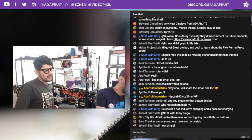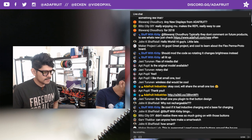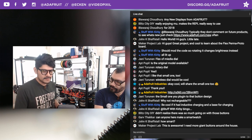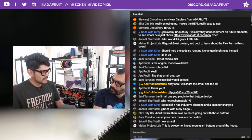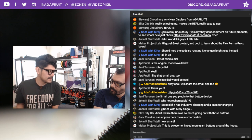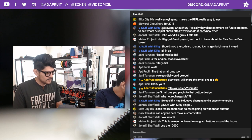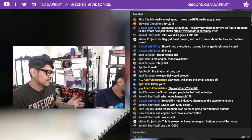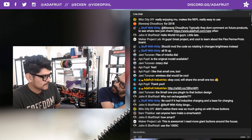So, you could put one of our micro LiPo chargers and wire it to it. Just a little bit more to do. I think the main use for it is we kind of want it to be plugged in to your computer or whatever, because it is using the Adafruit HID library. So that means you can also do fun things like make it click. Lamar wrote the code in a way where when you press the button, it's also going to mouse click. It's sort of an optional thing, but in order to do that, you kind of need to be powered through USB. Or at least connected to USB.